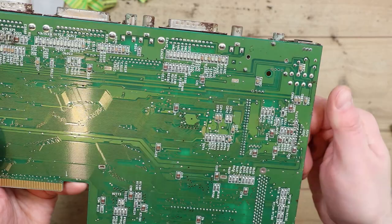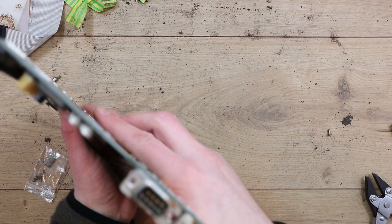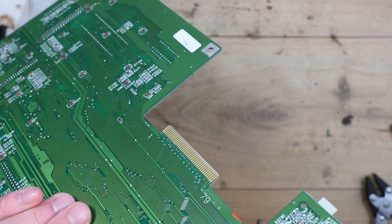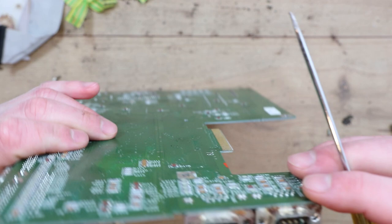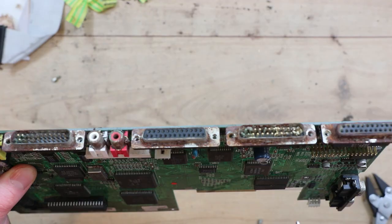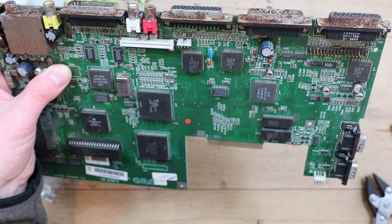The pins in the PCMCIA slot don't look too bad — though is it PCMCIA? Or is it CF? I'm not sure. They've got a bit of green on them. I think you can buy replacements of those. Obviously we've also got an IDE connector here, and these pins look bent on the end. In fact, that pin is decidedly breaking off — yeah, that's now snapped off. So that IDE pin header is going to need replacing, which is going to be interesting as it's quite small. Yeah, another bag of problems — I've got no idea why I bought it.